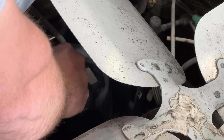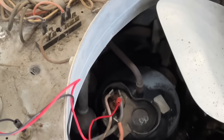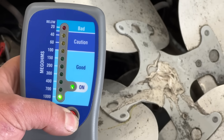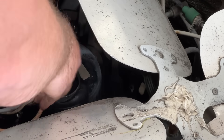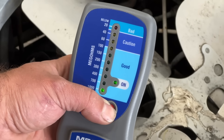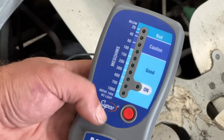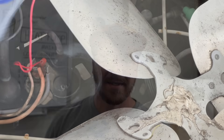Moving on to the orange wire — ground is right here on this bare spot. Let's test it out. Lastly we do the final winding as well. All of these on this compressor are 1000 megaohms or greater — this compressor is still good even though it's 30 plus years old.